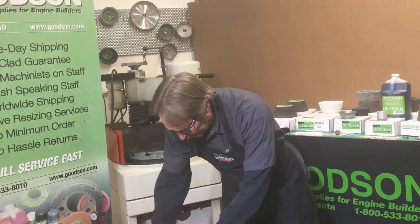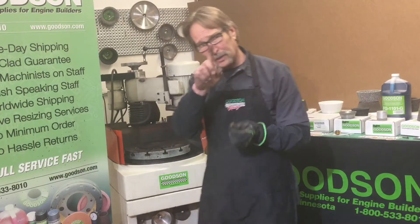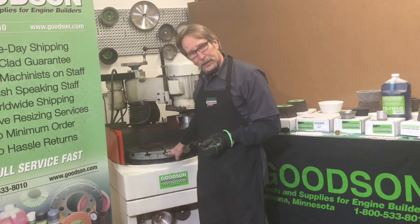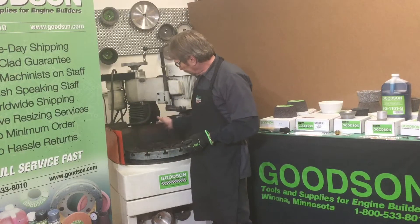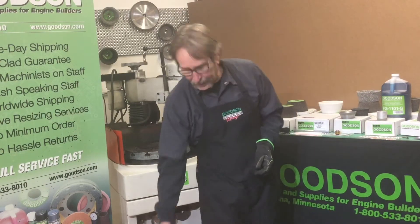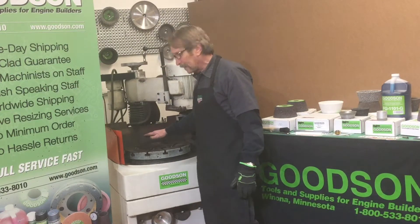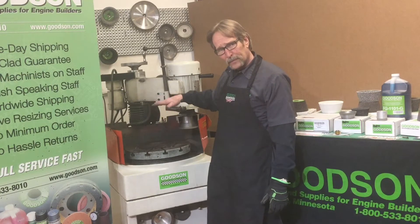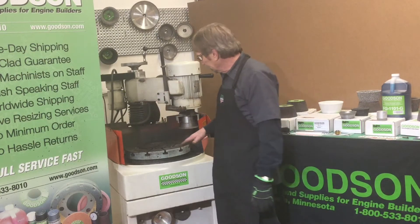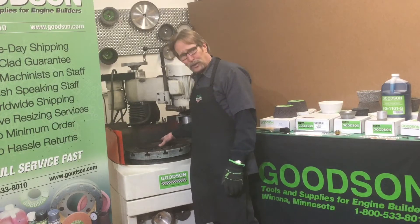The Mighty Bite has a cam action, and we still mount it through the T-slots of the table horizontally — probably three places, which is how many come in the kit and really all you need. We want to keep it from moving left to right; we've got gravity and grinding pressure holding it from moving up and down. We've already straightened this, which is why it's sitting on here nice and flat.